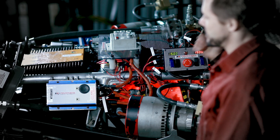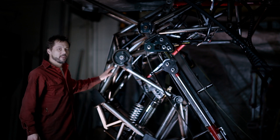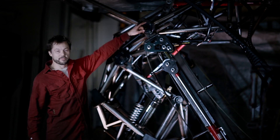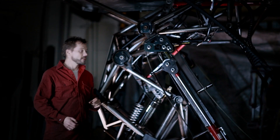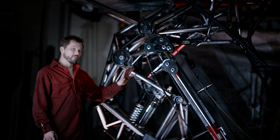So let's see where this power goes — let's check out the leg. The leg is where the muscles are. We have two hydraulic cylinders, one for the knee and one for the hip, and they extend and retract. They make the hip swing back and forth and the knee retract and extend. They're controlled by two solenoid valves from HydroForce, and they are what make the leg move.